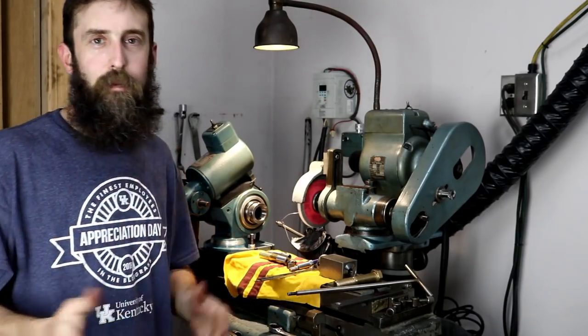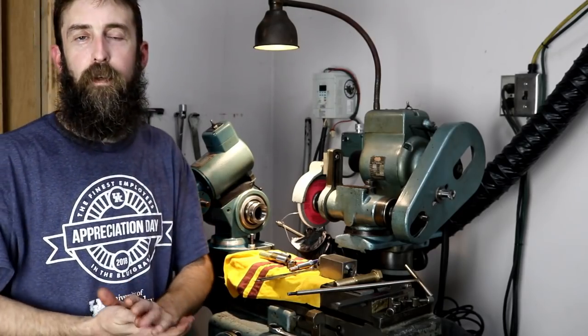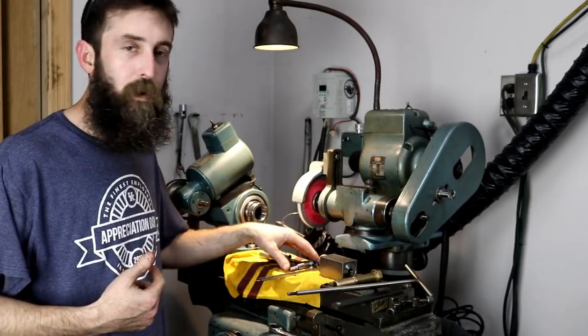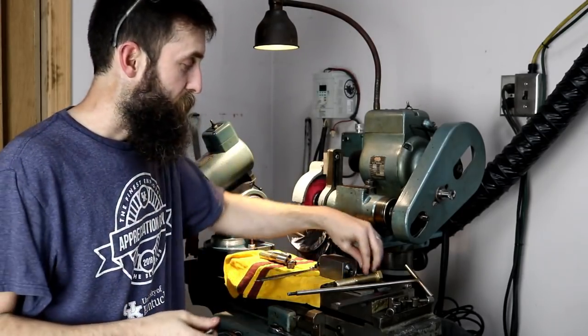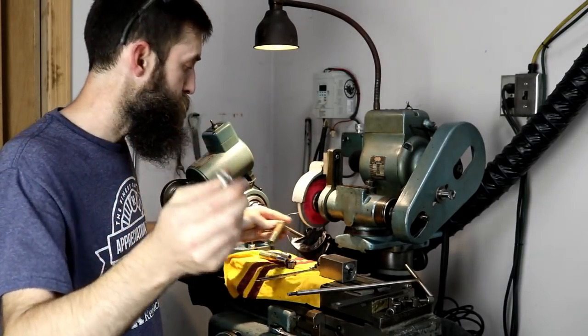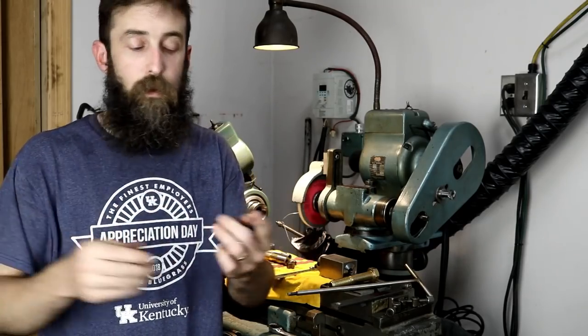Now, I've run into a problem, and probably most people wouldn't show you this. They just go on and fix it off camera and do their thing. But I want you to see this because I think it's kind of interesting what I run into. It's my fault, but it is what it is, and I want to show it to you. What we did originally, held this in the four-jaw. I put a center in here and supported it with the tailstock, and then we worked all these features. What I failed to do is double check my tailstock for alignment. I aligned it not long ago, and I guess I've bumped it or something since then, or it just moved.